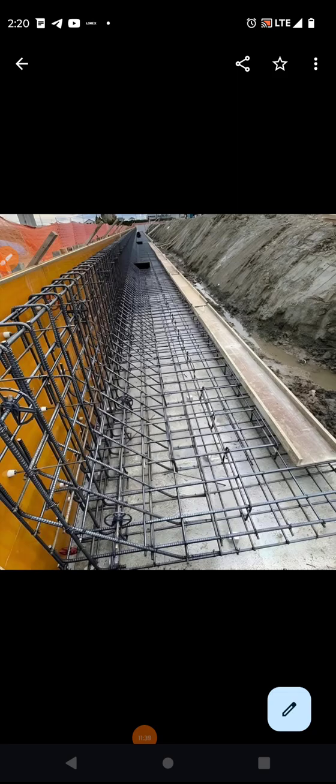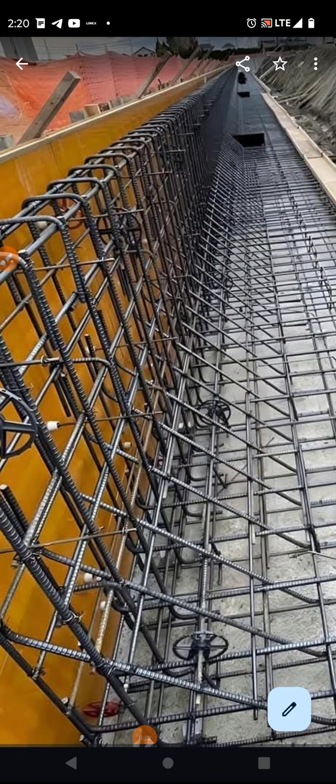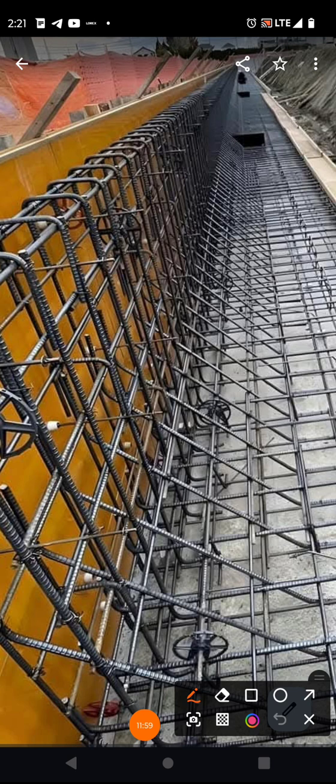Again, that reinforcement on the right side of that wall, at the tension side that gets put under tension when the wall gets loaded. That's the one that this reinforcement, oops, trying to get my little pen up again. There we go. That this one should have been more on that one like that, and develop it more. They could probably roll it back also to tie in the wall a little bit, but this is the one that's going to be in tension, trying to roll over this one there.